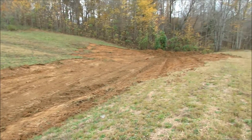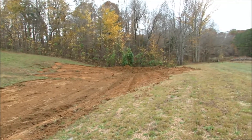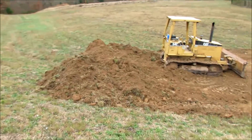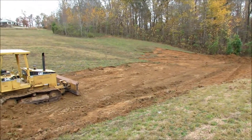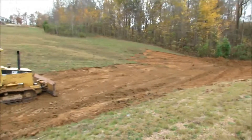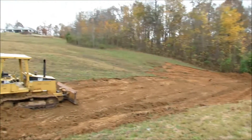I'm going to take the topsoil off and see what we're working with. With the topsoil stripped off, you just want to take this topsoil off kind of under where the dam wall is going to be. I like to make a pile behind the dam wall and pile all the way up past the water line, then cut into the sides where the water line is going to be — you don't need grass growing underwater. We take that topsoil and put it around the dam and on the dam so we can actually grow things.